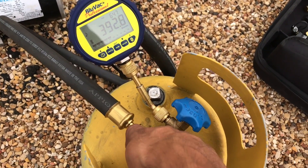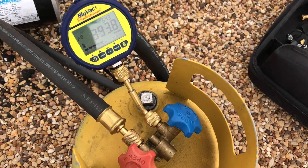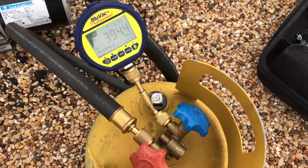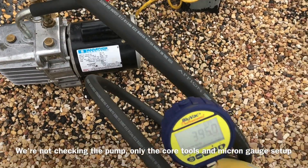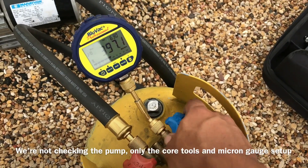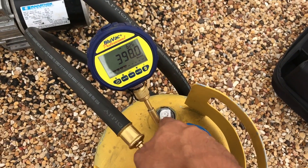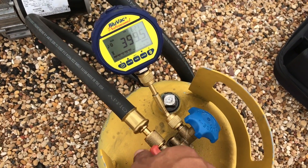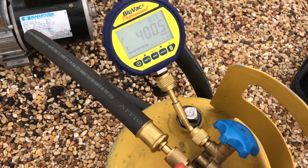This one's closed, by the way. So you're just concerned about leak rate. You can test it — don't test it at the pump because there's not enough volume. Put it on the tank. You can put a cord tool too, to check the cord tool, to make sure it's not leaking. You can see the leak rate's very slow, so that's good.